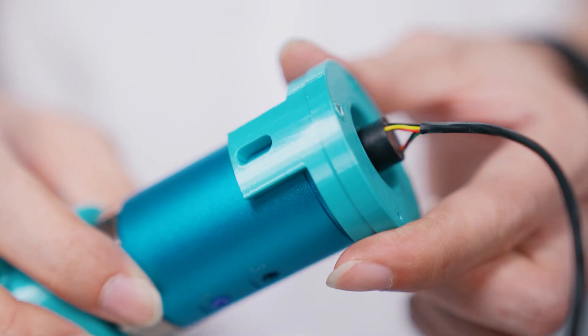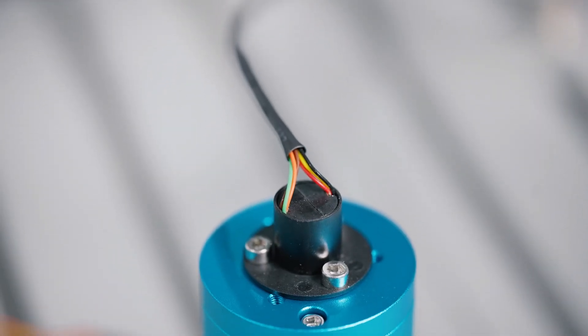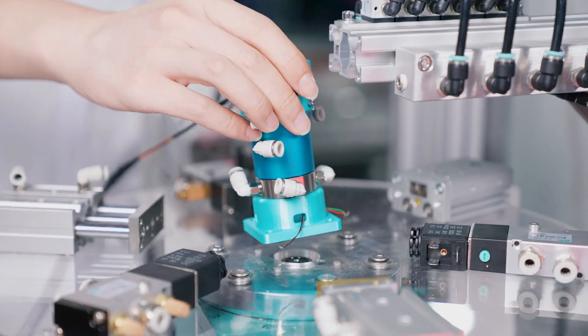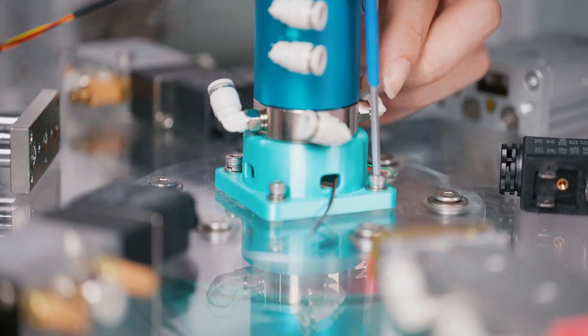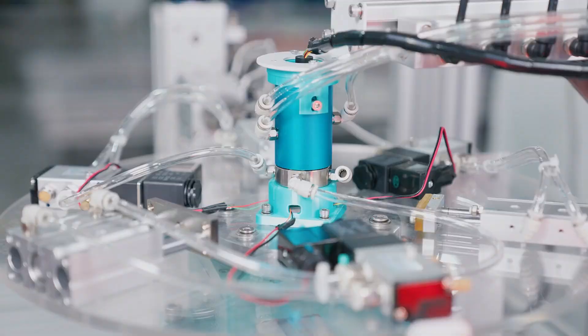First, install an adapter at both ends for easy fixation. The six wires on the slip ring are connected to the power, and the six below pass through the through hole. Then fix the connector. Incoming and outgoing wires are the same color. Connect the slip ring and the actuator — the installation is complete.